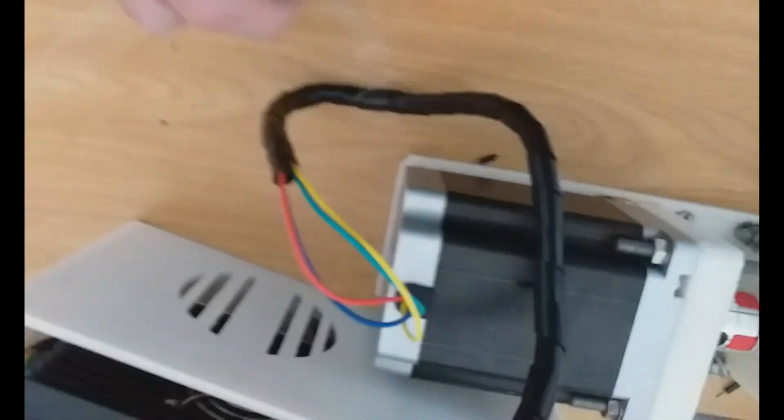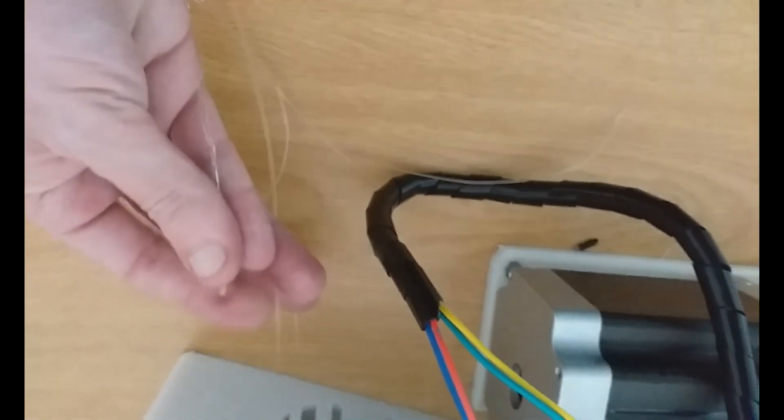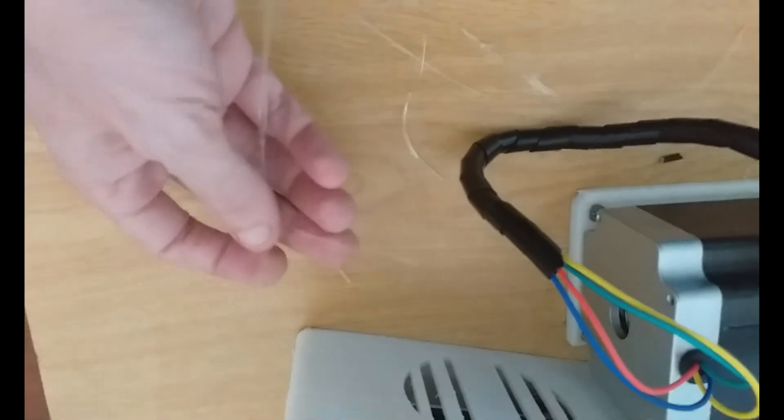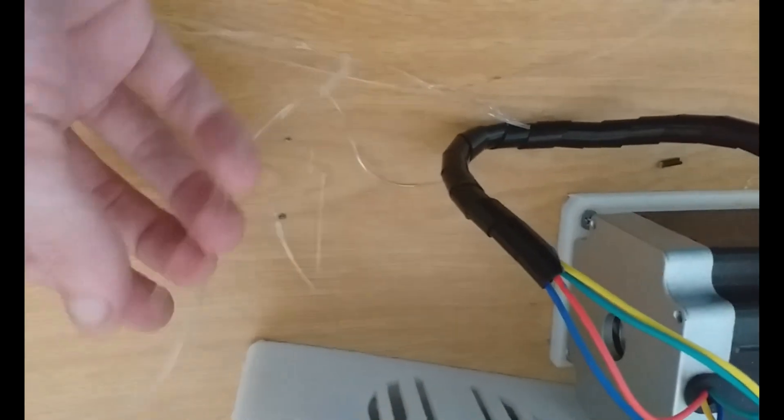I've got my bag of pellets or granules. The next challenge is making sure the filament itself is acceptable quality. This filament I've printed before tends to be quite brittle - it bends a little bit but breaks super easily. I think it's pulled moisture, especially when pushed through the water bath. I may need to get something to mix with these granules. I need to sort this out before getting it onto the puller system, because it'll just snap going around a spool.